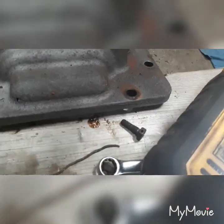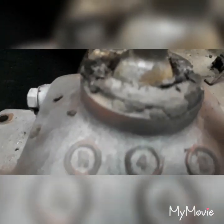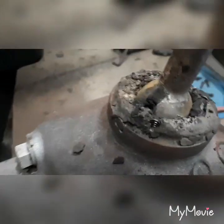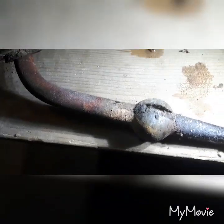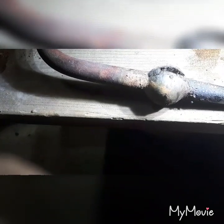It's supposed to go back and forth but not that way. Let me get the camera so you can actually see what I'm doing. It's all right there in that pin - you can see it. So I either got to build that pin up or build that little groove where it sits. It's hard to see on camera but it's worn there. I'm thinking I'll either lay a bead of weld in there and then take my cutoff tool and make a new slot.